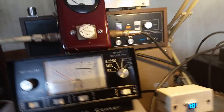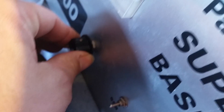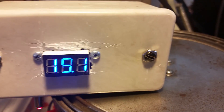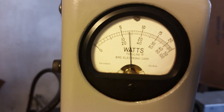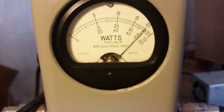I put a new knob on there too. We're dead keying on 1 watt with the radio on a 1000-watt slug. If I turn this all the way up, your dead key is going to be about 210 on the Bird — that's a little high. So I'm backing this variable down and your dead key is about 100 watts. Then we swing — right there about 900 to 950 watts. That's 300 watts RMS hitting about 900 to 950 watts peak-to-peak.